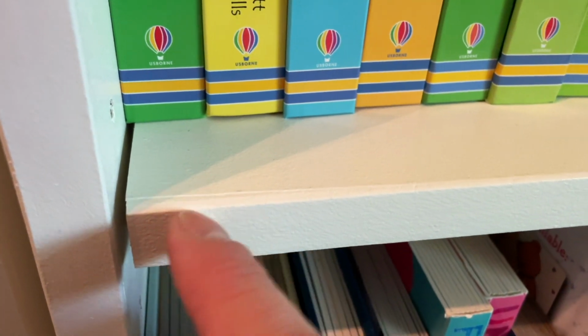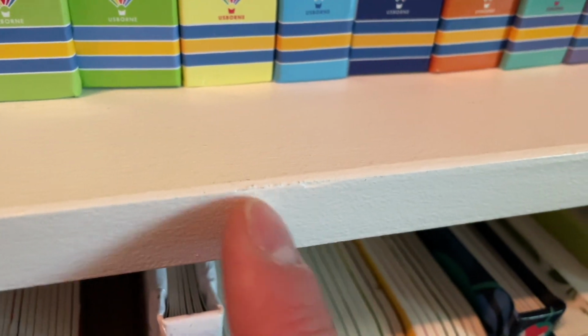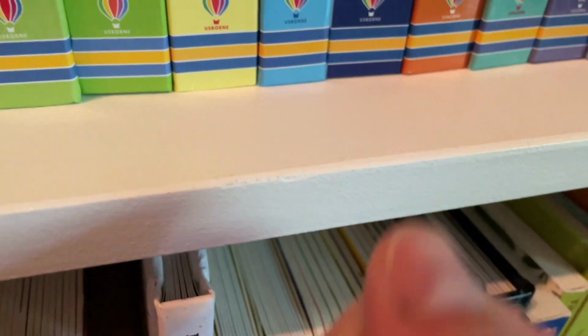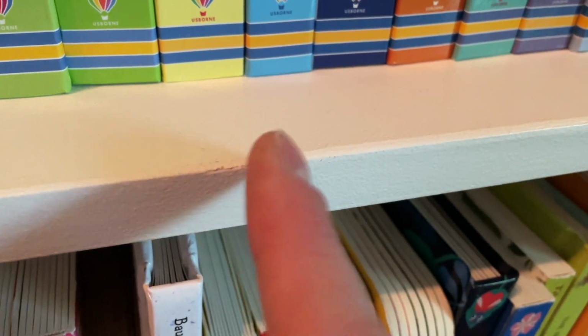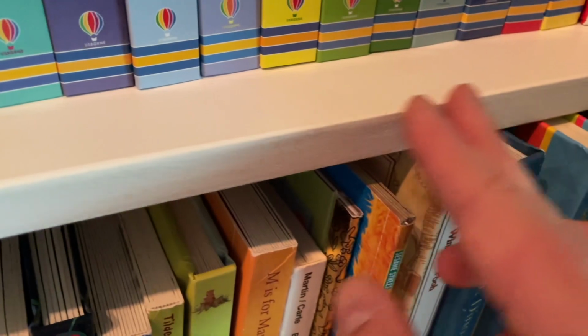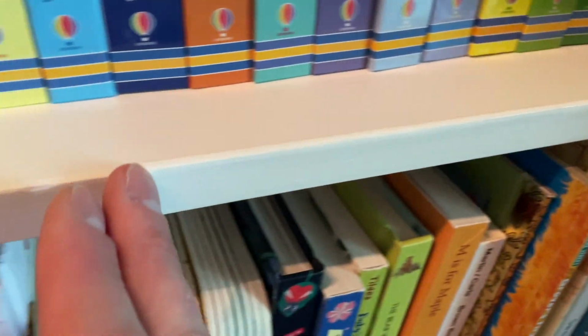And another edge banding issue is just how rough it can be when you don't cut it clean. So you can see some of the edges here. And I had originally used an edge banding tool to trim these off, and it would just tear out because the edge banding that I ironed on was pretty low quality. Now, when I do use that type of edge banding, I just use a knife along a straight edge, or I just use the router.